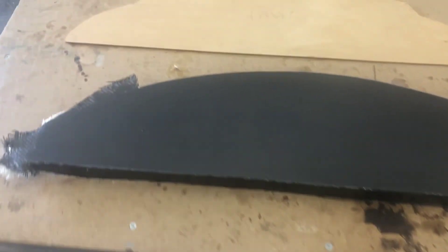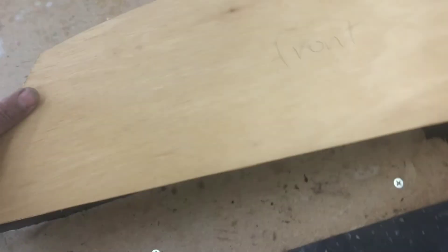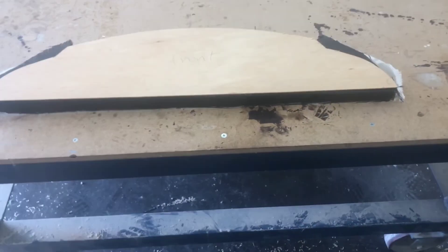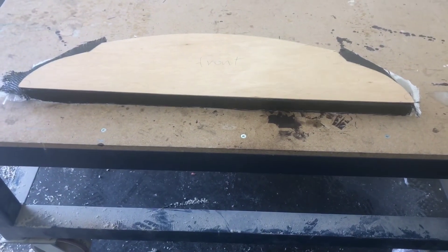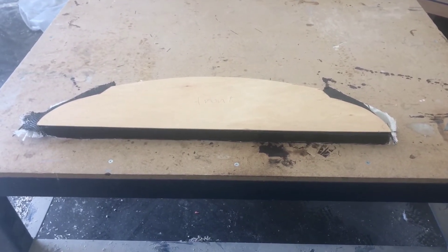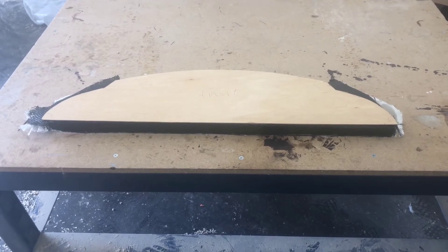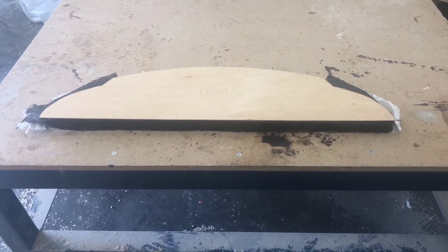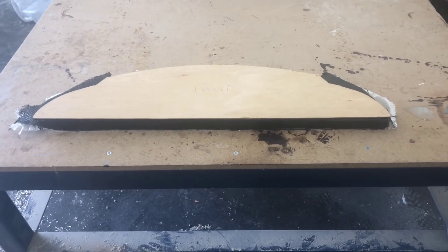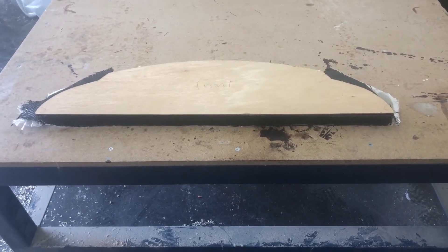Other than that I am happy with it. I'm going to go ahead — here's my pattern — so I can put my pattern on here and trim these edges that I purposely left long. I had it fit up here on the top just perfect but on these edges I just left them long, so I'll have to trim those and then it should be ready to go in the airplane. I did have a leak from duct-taping it down to my mold — so I think if I'm doing a totally flat product the duct tape is a great idea, but where this had some three dimension to it, with my pleats on the ends I couldn't get it all sealed off. I think I'll go ahead and get some of that seal putty that they use and use that next time.